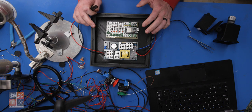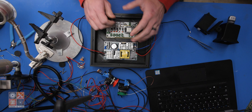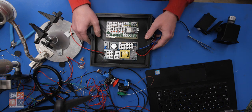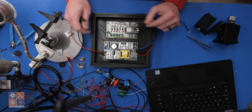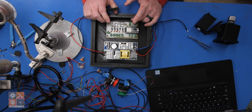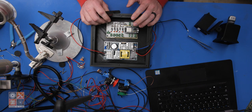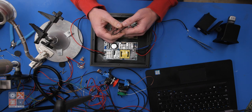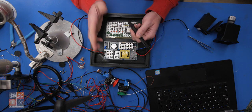So now is a good time to talk about the electronics and the operation of the doggy door. Now, I was originally going to have it fully automated so that the door would open and close automatically. So when a dog would approach the door, it would open and then close automatically. But I decided against that for a couple of reasons. The first, primary, is safety. Even at the low pressure setting that I have it at, the pneumatic actuator puts out enough force when closing that I was concerned about something getting caught between the door and the jamb.